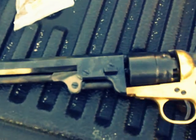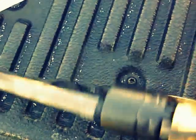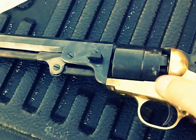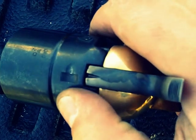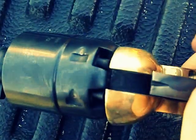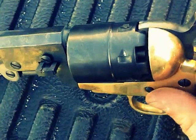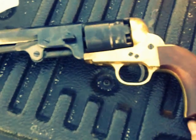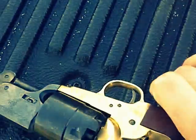Just going to keep this to a simple review. I'll post a video shooting it later, but it's pretty smooth. I took the whole thing apart when I first got it. It's got a couple jagged edges inside the frame, stuff that needs to be worked out. There's a little bolt — it goes in that slot when you cock it, catches it — it's a little too wide, I need to tune that. Hammer's pretty smooth, hammer spring, all the mating pieces were pretty good finish. I'd give that an A, A-minus, for overall quality of gun.